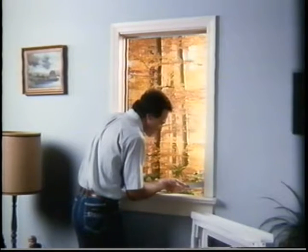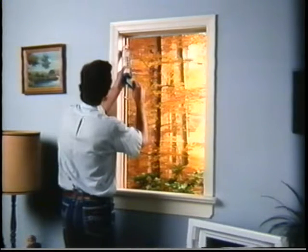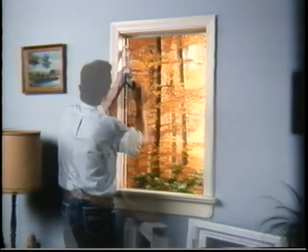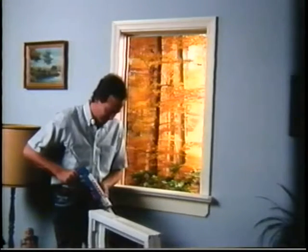Install the supplied sill angle above the blind stop. Caulk the inside and outside edge of the stool. Also, caulk along the outside blind stop on both sides and along the top. Place the supplied expander on top of the window and place a bead of caulk along the top of the expander. The expander legs may be trimmed if necessary to accommodate various opening heights.